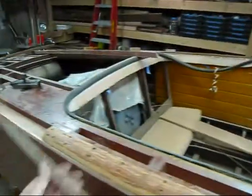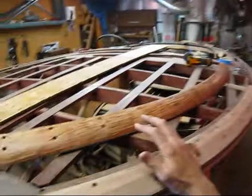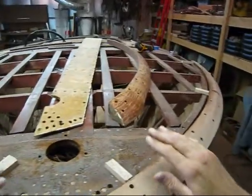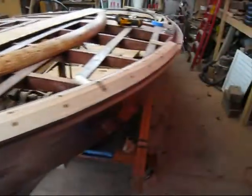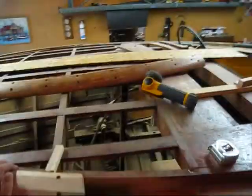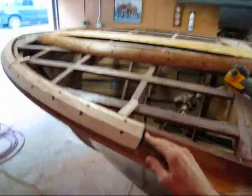So I had to work this down first. The next step is to lay out, mill, and install the covering boards. When I first thought about doing this — I've never done a whole deck before — I was trying to figure out whether I was going to put the deck planks on first and then the covering boards. But what I did was get these milled and decided it's better to actually install these on the boat. They're installed right now with new screws and 5200. Because if I were to put all of these on with these angles where the seams come together and then take them off to fit the deck, there's too much movement. When you go to put them back on, too many things are moving. So now when I fit the next covering board, I'm fitting to something that's already fixed — it's not going to move anywhere.